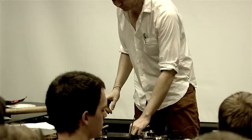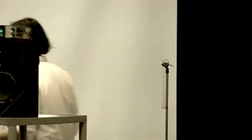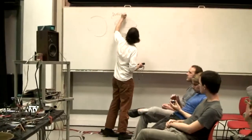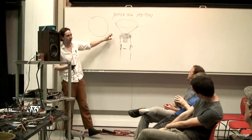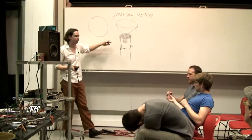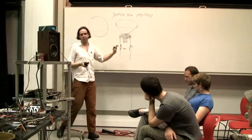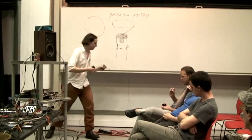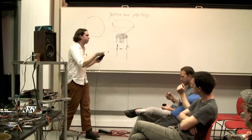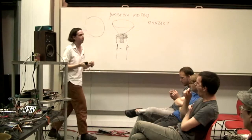We also have microphones idealized for listening to sounds through materials. We generally distinguish microphones from one another by either their type of working method or their application. By working method, we call this kind of microphone an electro-dynamic loudspeaker — or microphone — because it operates on an electromagnetic principle. In terms of its application, we call this an air microphone because it captures sound through the air. When we use it in reverse, we call it a loudspeaker, or a dynamic loudspeaker.